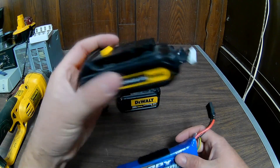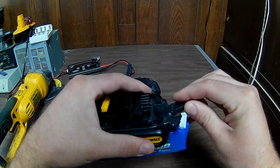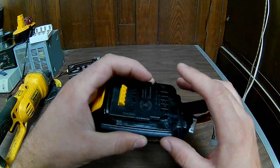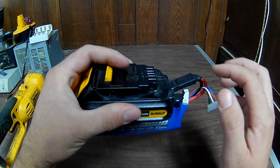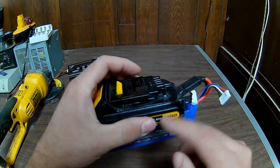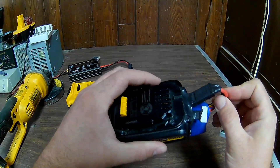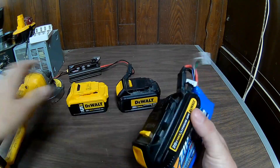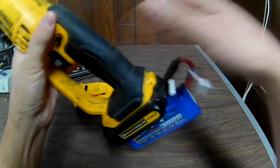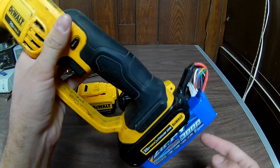After putting my own connections on it, I put some velcro on the LiPo and can now plug it into what was a battery case — now just an empty shell. These cases have a little chipboard that monitors individual cells, which I didn't realize was that smart. At first I tried just the main connector, but it wouldn't work. You need the balance plug connected so the chipboard can see all five cells.